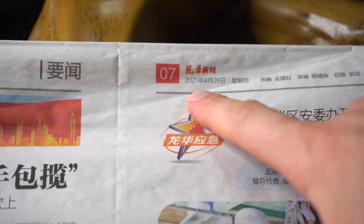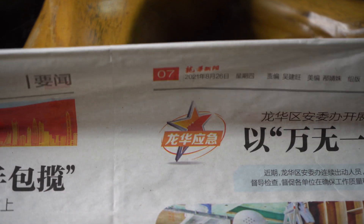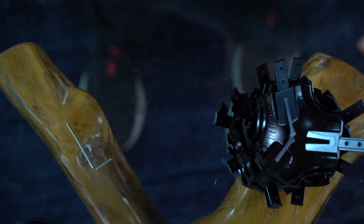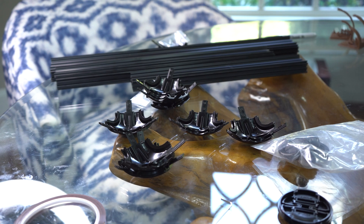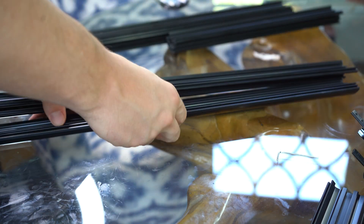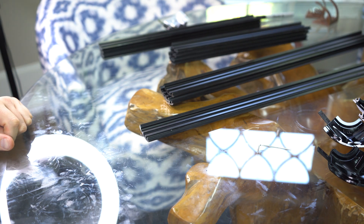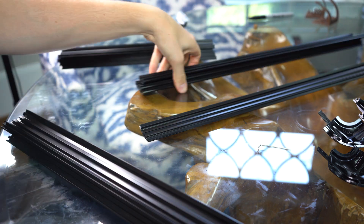What comes in the box is basically the frame enclosure, and there's also plexiglass or acrylic panels you need to fabricate or source yourself, and a couple of 3D printed parts like door handles. Unless my Mandarin is failing me, this paper is from 2021, which means this has been sitting around for quite a while. It also means this is from the beta phase of the BLV enclosure project, where there were some documented issues with the quality of the tabs on the extrusion corners — they snap off under pressure.